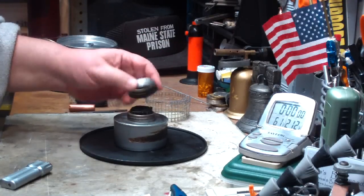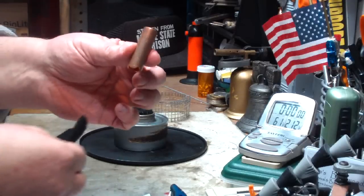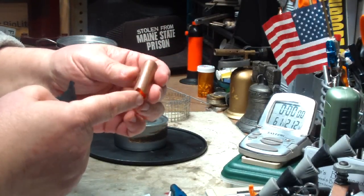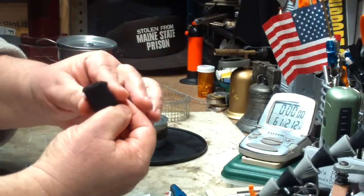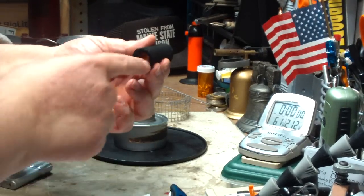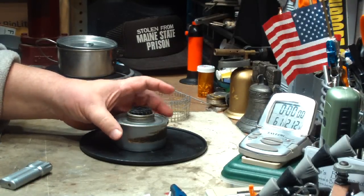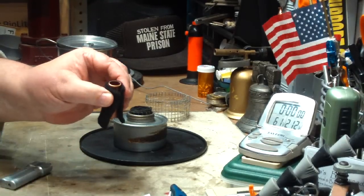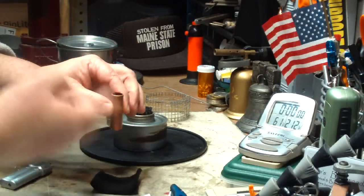What I did before was I rolled up a strip of carbon felt around a half inch copper pipe. I put some slots in the bottom of it so that if I wrapped it up with much more carbon, I could pour the alcohol in to refill the burner, and it would come out through these slots. But what was happening was, as the temperature built up and heated up the alcohol, this thing was so tightly wound up on the top that the expanding alcohol was pushing down and then up the tube, making it come out like a volcano.